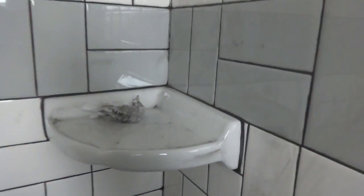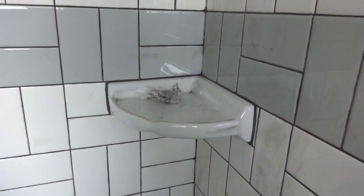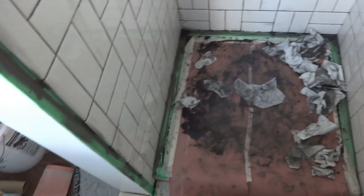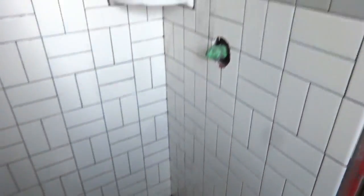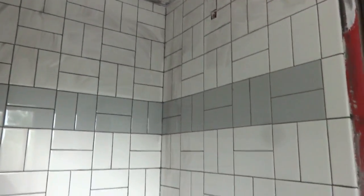We just finished the grout — took about four hours but it looks really awesome. The black grout really makes the basket weave pattern pop. When it's dry it's more of a gray color, but when it gets wet it goes more black, which is kind of cool. It made a huge mess on the floor and everything. I also went through with a little knife and scraped out the corners so that gets filled in with caulk. At the very bottom where the tile almost touches the pan I'll fill that with white caulk, and the corners will get black caulk. Otherwise the shower is pretty much done.